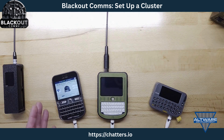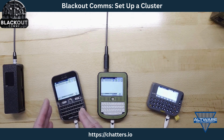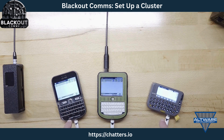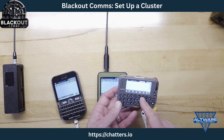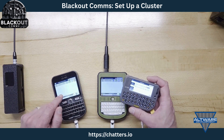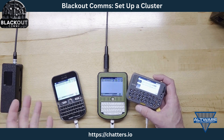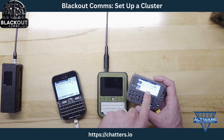Both devices restart, which means the TDECK Plus has everything it needs — now I have a cluster of three. The pager and TDECK Plus haven't met yet since they never onboarded together directly. Trust information is exchanged automatically, but it can take a few minutes or even an hour. If I'm in a hurry, I go into settings on the unknown device, choose cluster, and select 'broadcast my identity' to force the exchange. Now it knows that device is TD Plus.